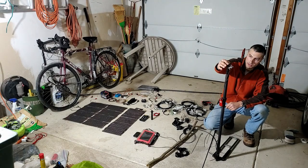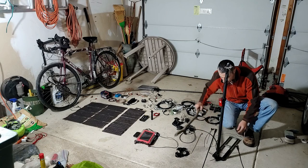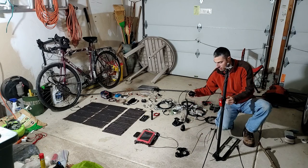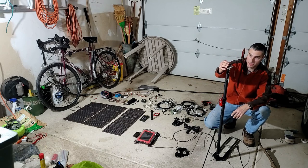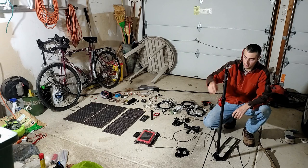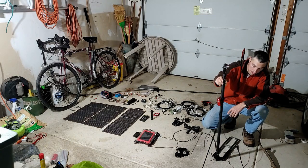And this connector on the top is actually a direct crimp onto the coax. That's the coax cable here linking the radio and the antenna. There are no adapters up inside there. The SO239 is directly crimped to the cable, and then it's epoxied in, so it's pretty strong in there. And this is 1-inch PVC pipe, nothing fancy.